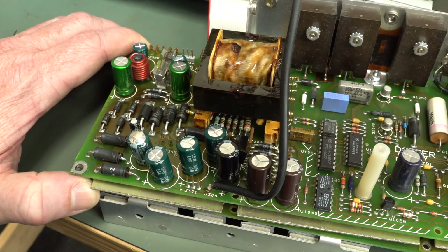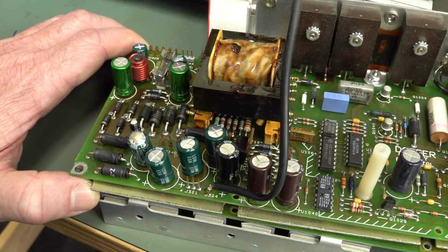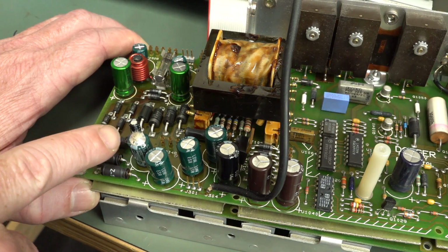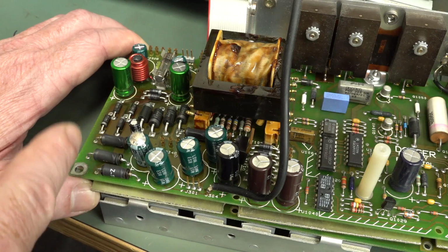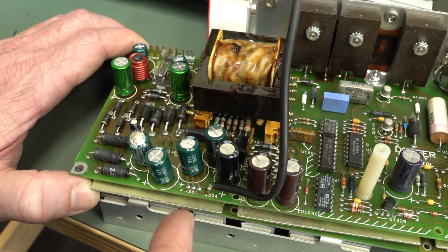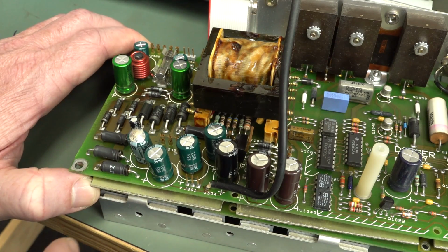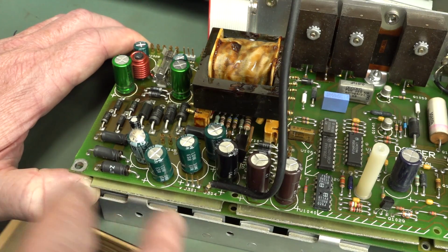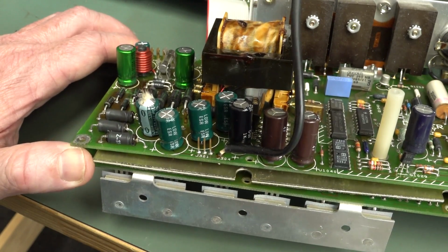That doesn't make sense. Power supplies only hiccup like this when they have overcurrent situations. So yeah, it's obvious. This thing was in backwards. It was drawing a large amount of current and effectively shorting out that rail, or loading it more than its protection current, and the power supply was hiccuping. Hiccup, hiccup, hiccup. That's what good power supplies will do when they have overcurrent protection. They won't just shut off. They won't just blow a fuse. They'll try again and again, shut down, try again, etc. And yeah, the magic smoke escaped.